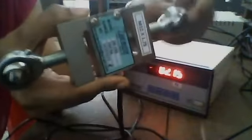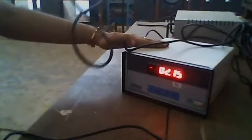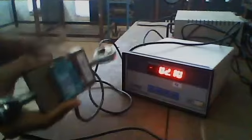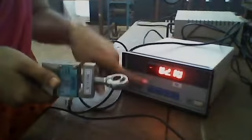You can see here there are two nodes. It should be connected to this portion — it can be in a loose position. First we have to calibrate it by connecting it. This instrument is a load master, which represents how much force is applied on this load cell. It will be indicated digitally. Either compression or tension can be measured using this load cell.